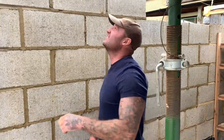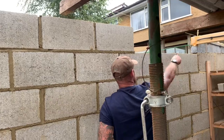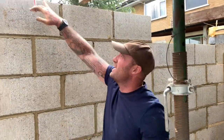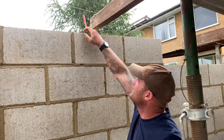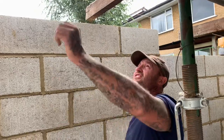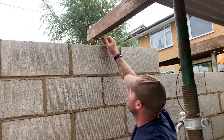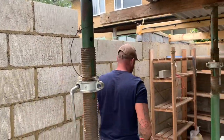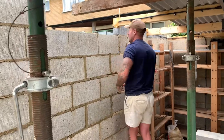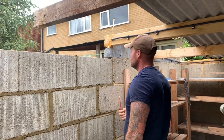Right, so what I've done is I've plumbed the line up, put them on all the joists right the way through, okay? And that helped me mark and use as a profile to put my angled cuts in, my raking cut. That'll go in nice and smooth, top of the line. Then obviously the roof will sit on there. Now the problem I've got here is we're a bit low. You can see here he's used thermalites. Had a cheat up, chuck thermalites in, easy to cut around.